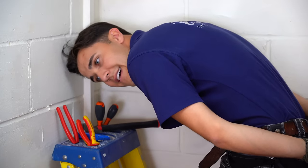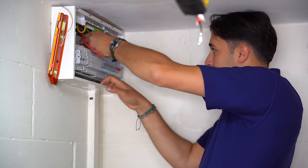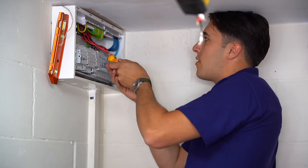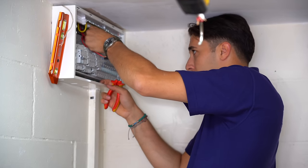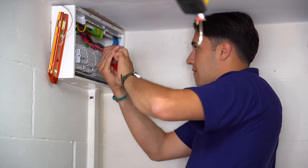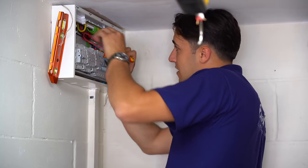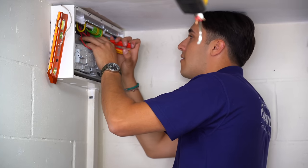It's not a very ergonomic workstation for someone with a damaged spine. We've got the last circuit now and I'm just connecting it into the consumer unit — everything else is already on and tested. You always want to do dead testing before you change the consumer unit, especially when you're putting in RCDs that weren't there before. We already did it on the periodic inspection, so I'm hoping it'll be a nice clean swap. But you can't really tell until you power up and start functional checking everything.